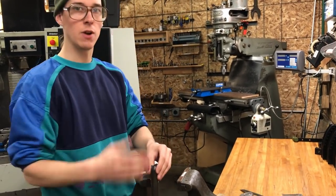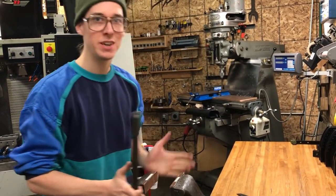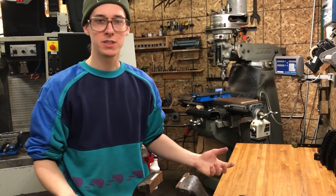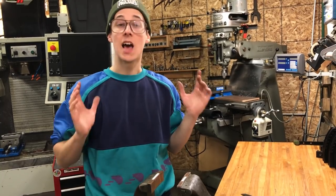And then you just want it roughly at elbow height. You don't want it to be jiggling around on you. You want a nice heavy bench vise on a heavy bench. And then a halfway decent file and just get to work. And it's all about, you just got to practice it a little bit. Hope that's helpful to you.